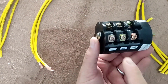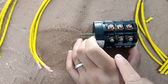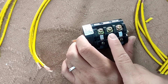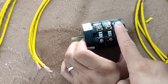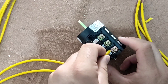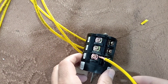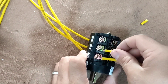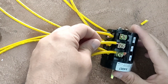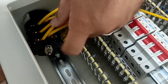A switch for emergency power is installed in this switchboard. There are three inputs for city electricity, three inputs for emergency power, and three outputs for panel electricity. In this step, we connect the wires to the key, then install the key in its place.